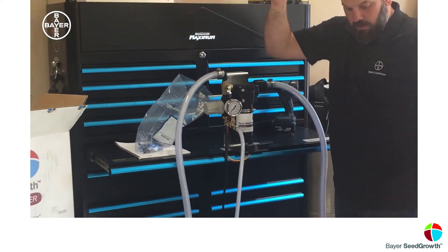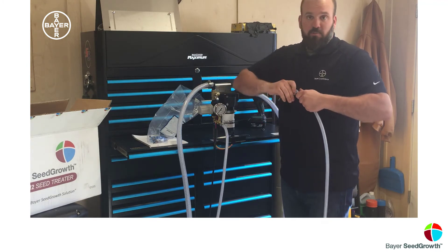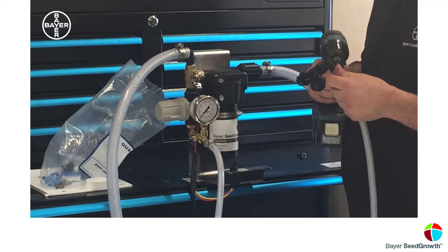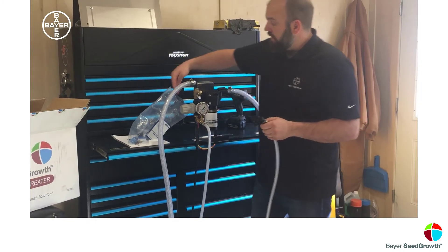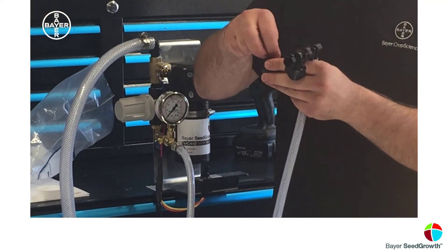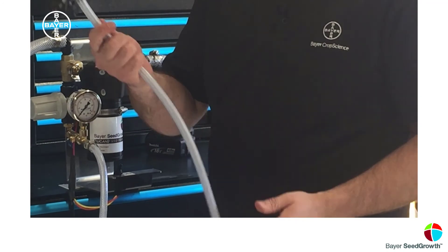In your bag is your nozzle. We're not going to get carried away today going through all the nozzles — this is just your simple nozzle valve assembly that you'll see on any small seed sprayer or anything like that. Push this on and tighten. As mentioned, all the charts in the book will tell you what color nozzles to use. In here we've got multiple gaskets — for example, I'll just do a brown, so you simply insert the brown into the nozzle. No different than every other nozzle you've used on the farm before. Put your rubber gasket in and attach. Quite simple.